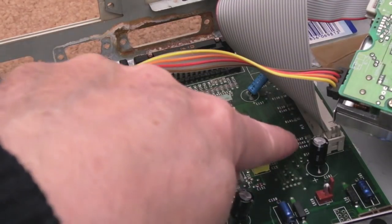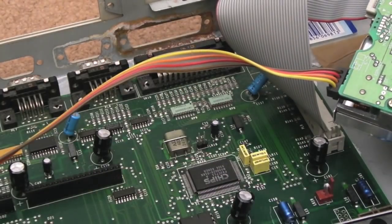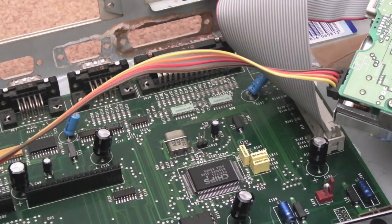The next thing I might do is get a bit of flux onto these resistors here and just reflow those, just in case there's some weird thing going on due to this detecting something from the drive and maybe raising an interrupt. Something weird going on there for sure.